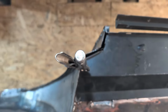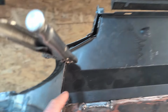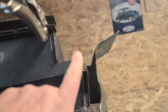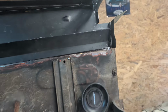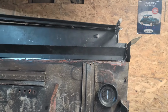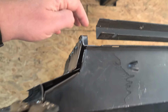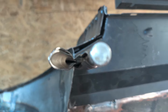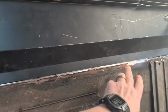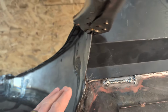Well, then of course somebody said, well, why don't you weld it in as it is now, because that fits great. That's brilliant. And actually this fits great all around here. You can see it lines up lovely. So the comment really is, weld it in, your Wally. Just get that welded in, get that sorted out, and then once it's in, and you can see here it even lines up pretty well. So tack it in place, get this seam in place, and this is the original line you can see there from the old one, so that's pretty good too.